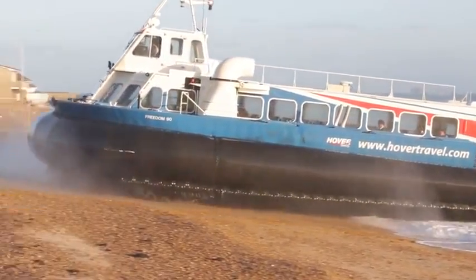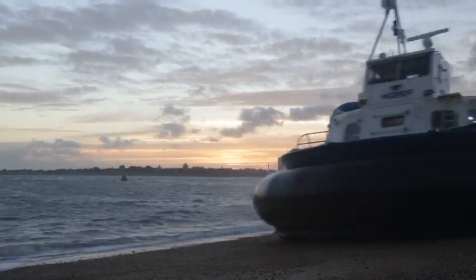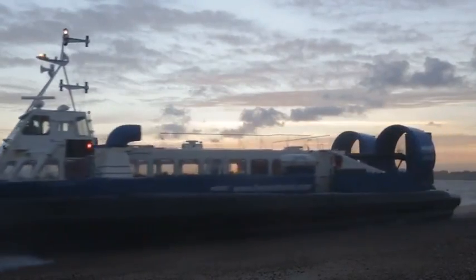The application of a hover system to an airship is slightly different but the principle remains the same. When we attach a hover system to an airship we refer to it as an air cushion landing system or ACLS. The large landing system distributes the landing load over a wide area and this enables us to build it in a much lighter fashion than the style of hovercraft you see here.